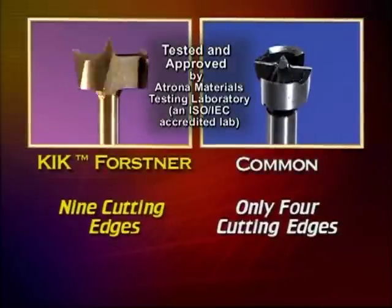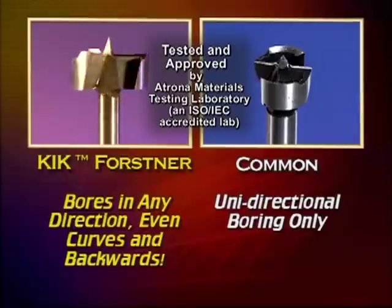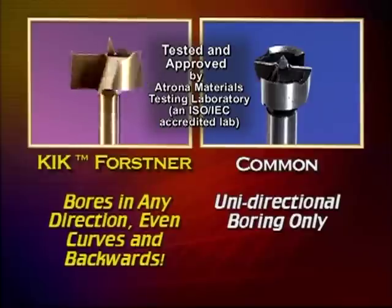The Kick Forstner has 9 cutting edges. The common Forstner has only 4. The Kick Forstner mills, channels, routes, and can bore in any direction, even curves and backwards. The common Forstner is only unidirectional and cannot mill, channel, or route.